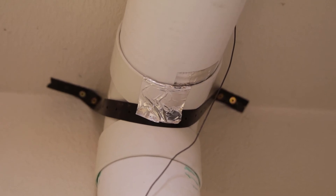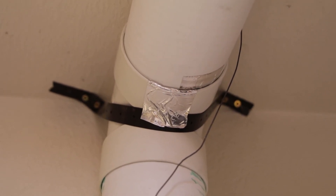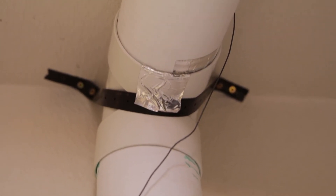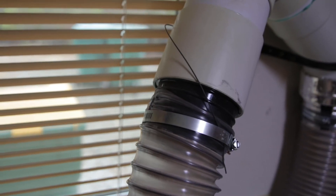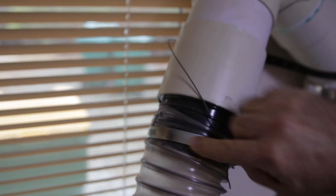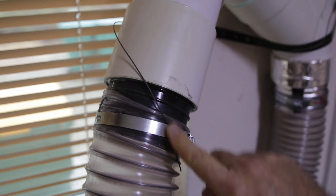Here's an example of the aluminum tape coming out of the long piece on the top, and then another piece on the bottom of that connector — the 90-degree that goes down the wall — so that goes all along the inside of the pipe. I still have the wire wrapped around the spiral of the pipe, just because that's what I had there before and I didn't remove that. The wire on the inside of this flexible pipe goes underneath the pipe clamp wire, and that's connected to the wire going on the spiral on the outside too.